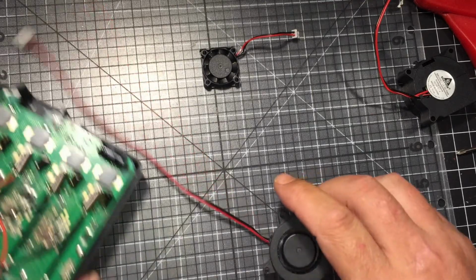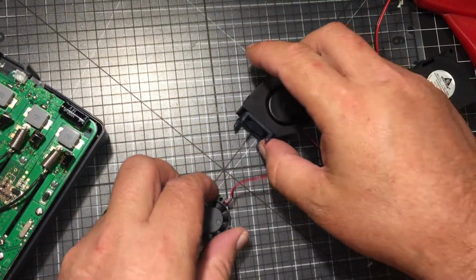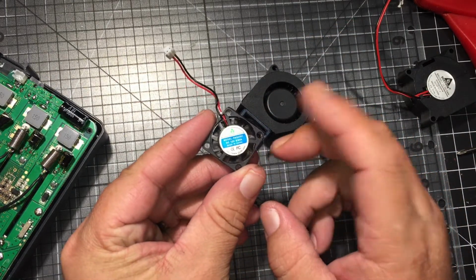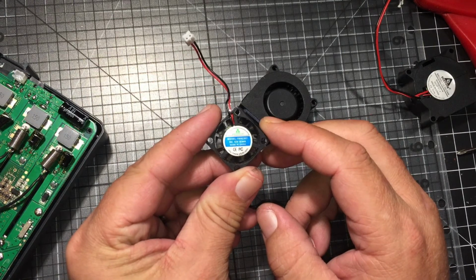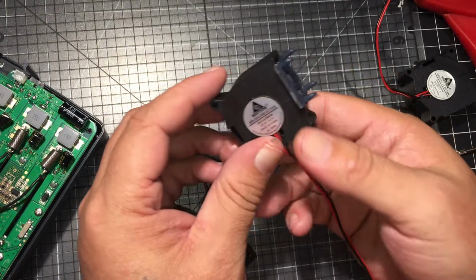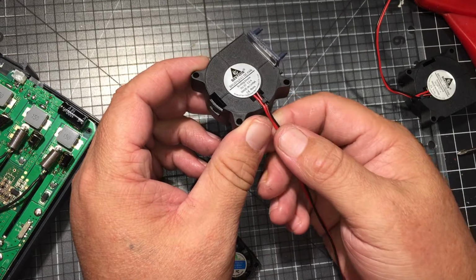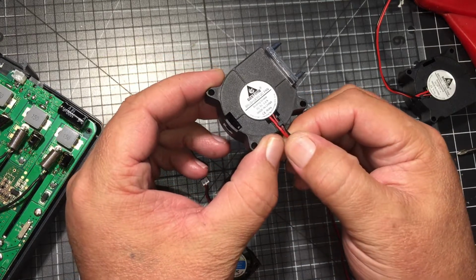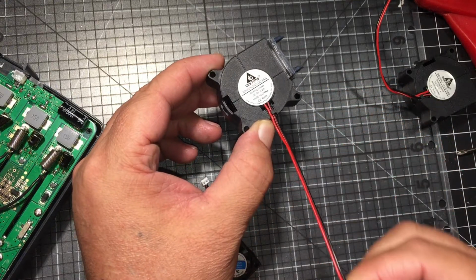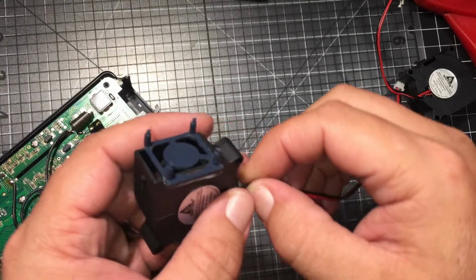All right, so if you missed it, hopefully, I'm probably not gonna post it, but I got in a conflict with the voltage. The Opus fan is 12 volts, 0.04 amps, and this one is 5 volts, 0.2 amps. I'm not sure if it's the way to go, but there seem to be conflicting results on Facebook. Some say that it looks fine, they never have an issue. I'm just gonna finish the mod, make the video quicker.